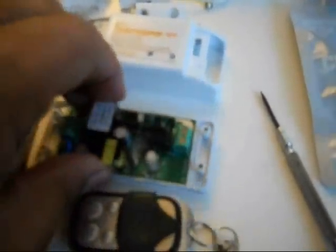And then to connect the wires, you have to screw this little screw till it comes up. Do that on all four. Then you could slide your wire into the slots and screw it down to secure the wire. Now that's the part that they didn't tell me. When I first got this, I never seen any connectors like this before, because like I told you, I'm not a knowledgeable electrician guy, so it took me a while to figure out, oh, well, no, that's how you do it. So I'm letting you guys know right off the bat, so you don't have to go through that.